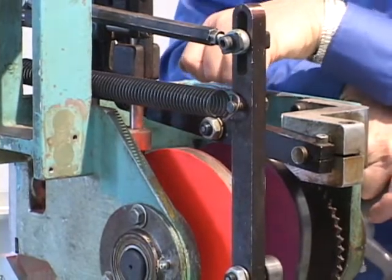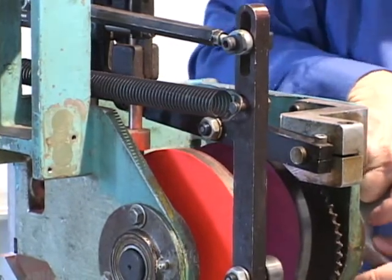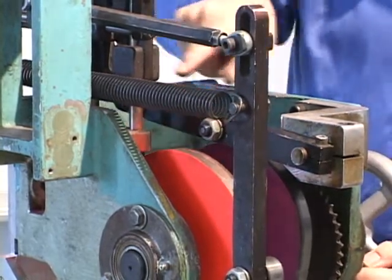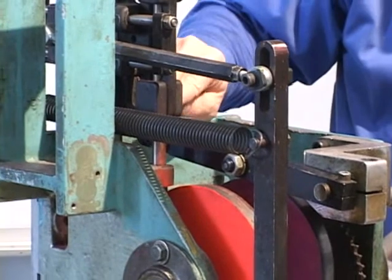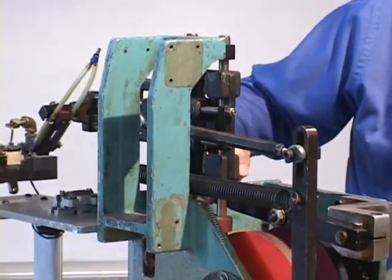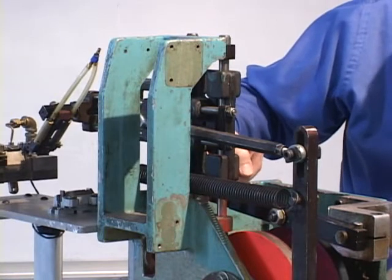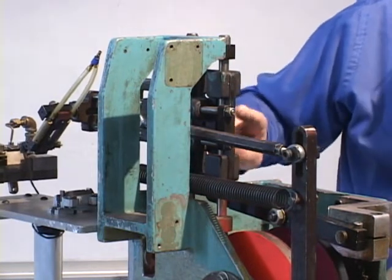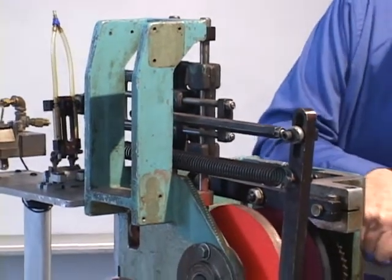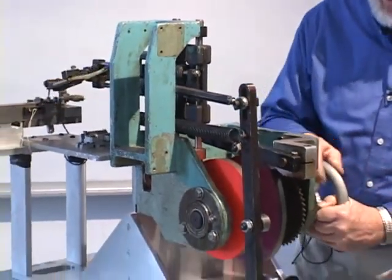The roller is right under my finger, and that's riding on the second cam, and that in turn drives this link, call that link 2, which in turn has a connecting rod, let's call that link 3. That's pivoted to the input link 2 here, and the connecting rod in turn drives the vertical slide up and down. So we have two coupled motions then.